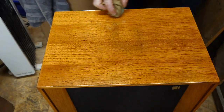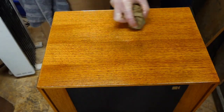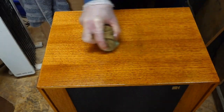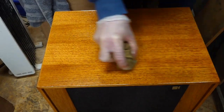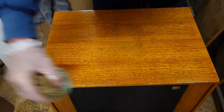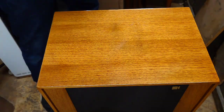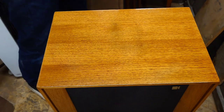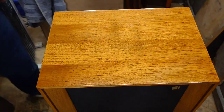Here we have the finish built up. I'm just going to do the last coat now. What will happen is I'll leave this overnight to dry, then tomorrow I'll come back in and flat it back with four-noughts wire wool to dull it down, and then I'll give it a coat of wax to give it that nice satin finish — to make it look more like an oil finish than a polished finish.